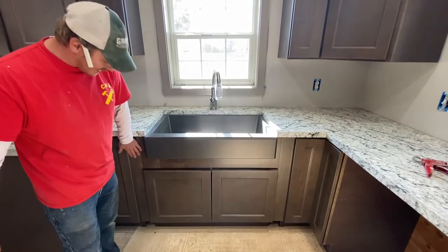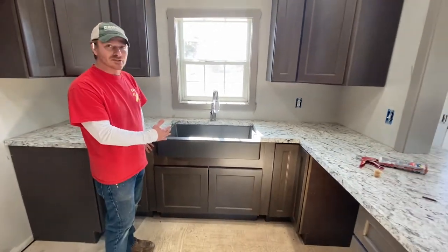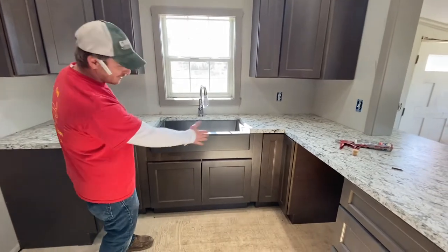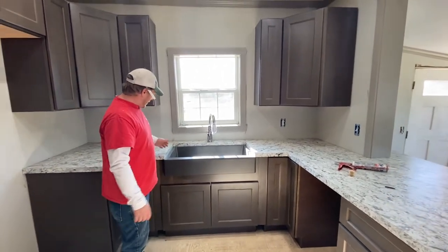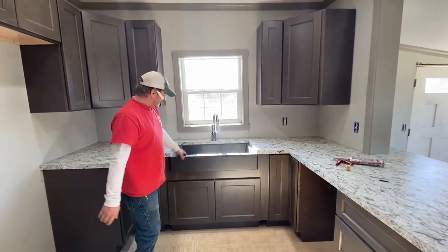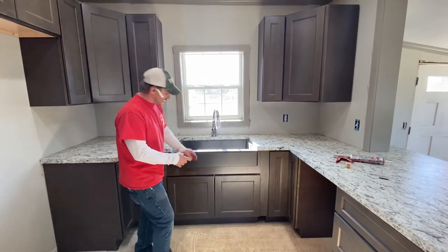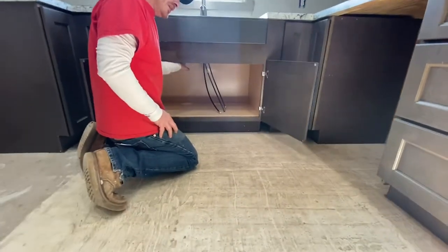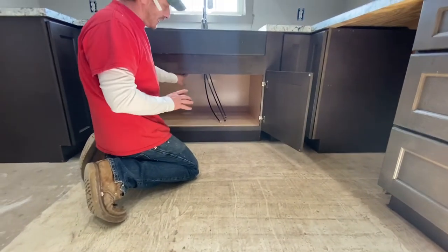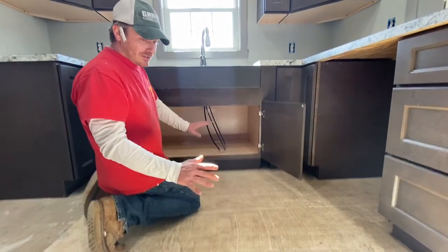And I got lucky, I got some fillers here because, again, the walls were out of square. So we wanted to make sure we had fillers in. It didn't look like you'd have much room for a cabinet anyway, but we made sure they were fillers so that we could adjust. So we got a frame and I was able to put screws this way. This was built for it, so there are also shims under here. I highly recommend that you do a frame and shims.